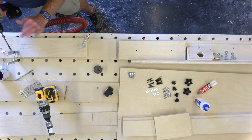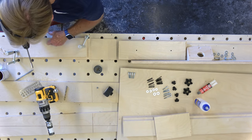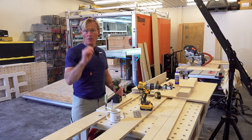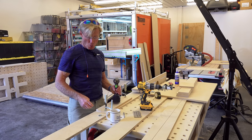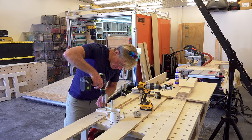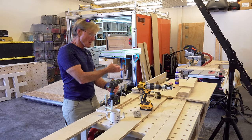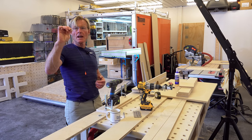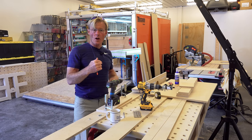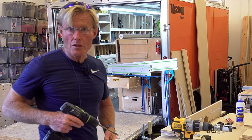I keep a whole bunch of quarter-20 nuts and I don't have to go to the store. I'm going to use four different drill bits to make each of these, and there's a process — you want to drill in a certain order. The first hole I want is the flat-bottom hole that the nut will be tapped into, slightly smaller than the nut itself. Seven-sixteenths seems to work pretty well. I'll eyeball the center and estimate the depth as I drill — I want to tap the nut down so it's at least flush with the wood, but I don't want to go too far because I'll be pulling against the wood that's left, which would weaken the knob.